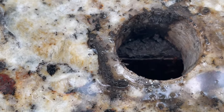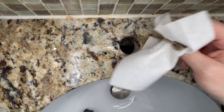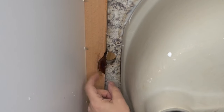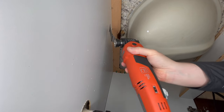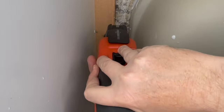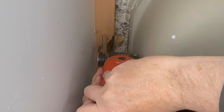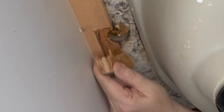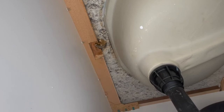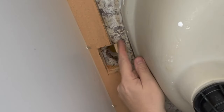Looks like it's been leaking for a little bit down in there — get that cleaned up a little bit. This faucet is not going to seal if it's not on a flat surface. Half on, half off is not going to work for us. Grab the fine multi-master. Layers — that was definitely just wet. We'll see if we have to cut more — yeah, that's gonna work out.